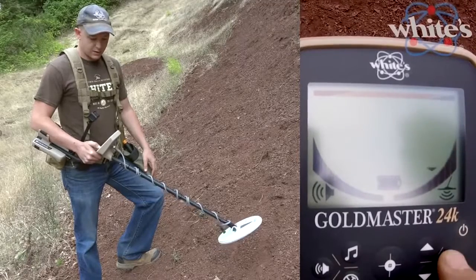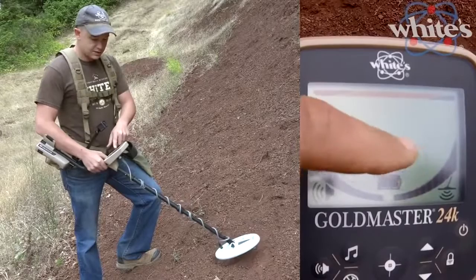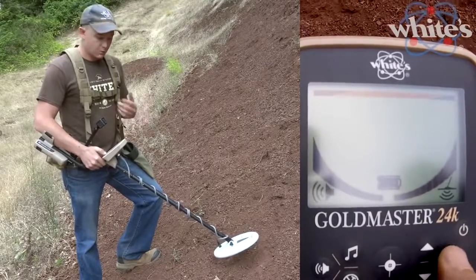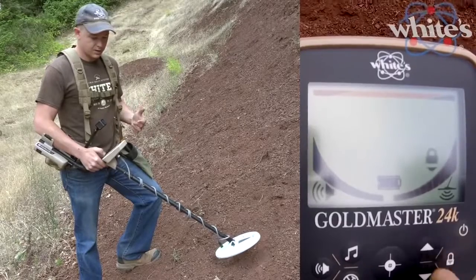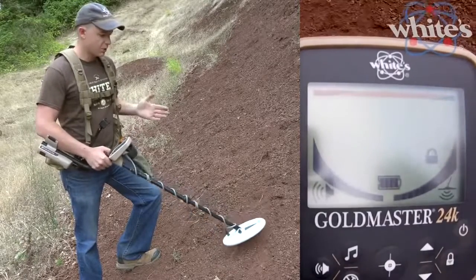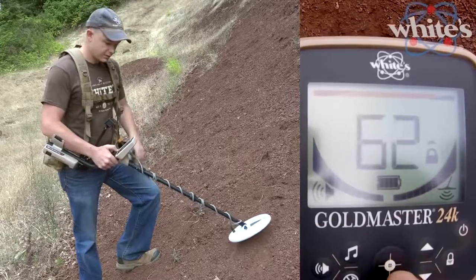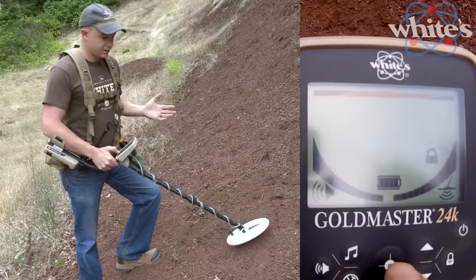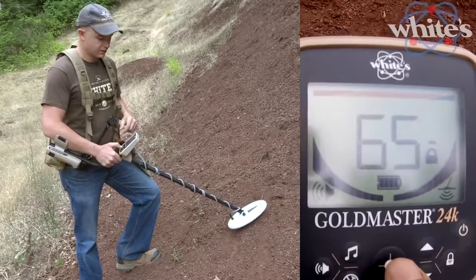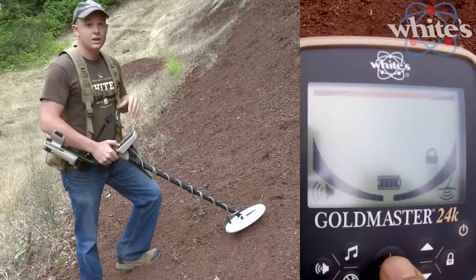The lock button — you can see the arrows jumping up and down because the machine is operating in XGB, the automatic ground balance setting. If you want to lock that setting, just tap it, the lock icon comes up, and now you're locked. If you want to update the ground balance while locked, just tap the bullseye or pinpoint button and that does a ground grab. You can see it flashes the phase of the ground on the display, confirming the machine has grabbed whatever ground is under the coil.